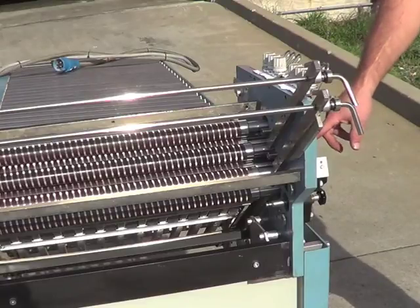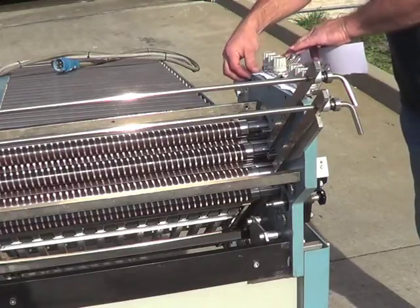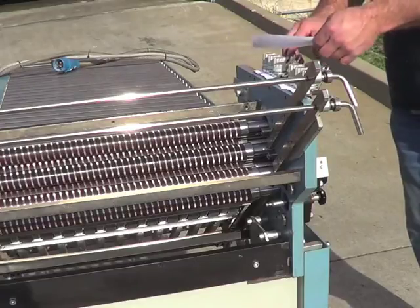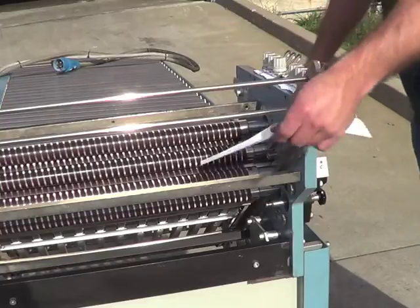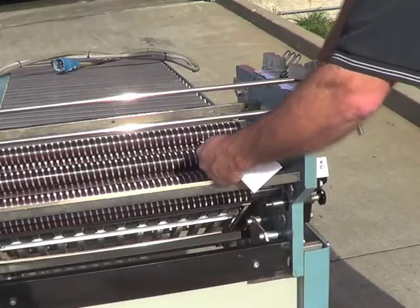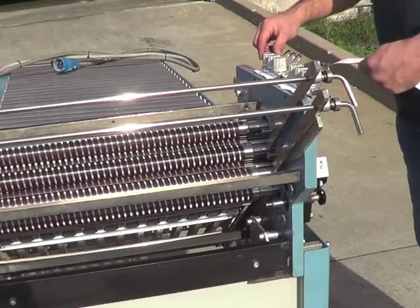After setting the spring pressure for the rollers, now we can go in and adjust roller pressure. In each one of the gap sets on both sides, place one sheet of paper underneath each one of the gap sets — both sides of the same paper that you're going to use for checking your roller pressure. Take about a 2-inch wide strip of paper that you can roll into the rollers to feel the pressure. It should be a light to medium drag pulling out of the rollers. Turning the knob clockwise is less pressure; counter clockwise is more pressure.